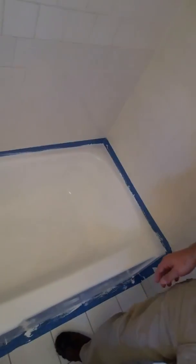You definitely have to have some brush technique — it's very thick. This isn't like a latex paint and it's hard to work with. It dries and sets quickly on one side, so you've got to keep your wet lines moving. Your wet line is where you leave off. If you're painting one section, you've got to keep going off that wet line — don't paint all the way around. Do one full side at a time, because if that side is drying when you come back to continue, it will all pale on you. But anyway, there's the first coat. Like they were saying, you really don't have to worry too much about your brush strokes — at least I hope.